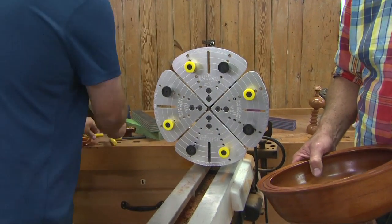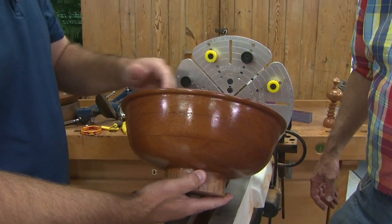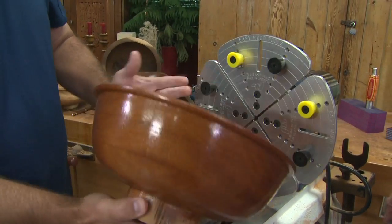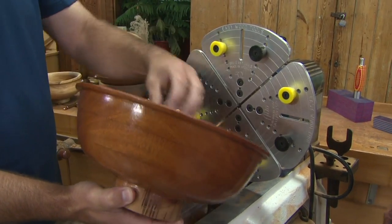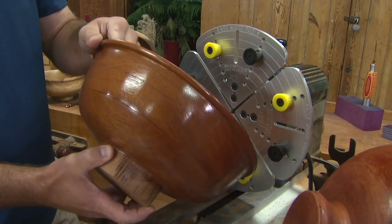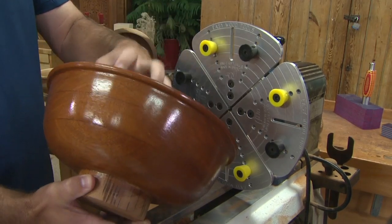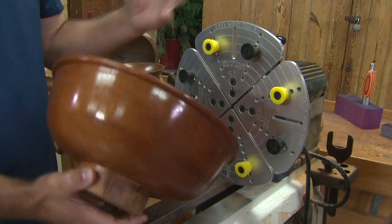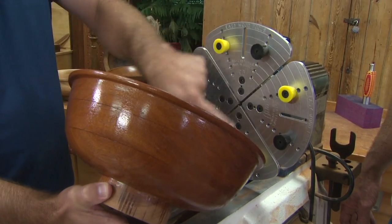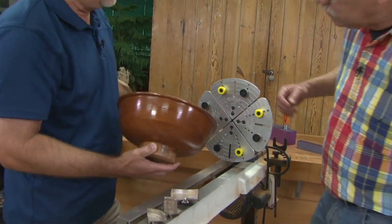To put your Big Easy Jaws on, simply slide them in to the click and you're ready to grip. Depending on your bowl size and shape, you'll need to consider whether to chuck on the rim or on the inside. With a lathe of this size, you don't even have the option of chucking on the outside. You turned your rim inward, so now we can chuck in expansion. At this point in your project, you don't want solid steel jaws gripping your wood. We have urethane grippers with a dovetail shape — soft so they don't mark your wood, and a dovetail so they don't pull off. The dovetail is the strongest coupling of two components in the industry.